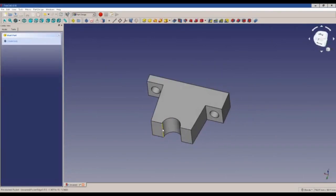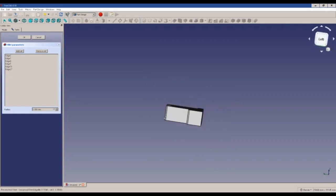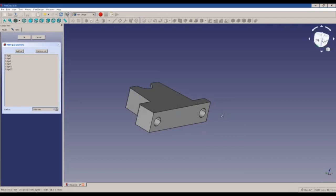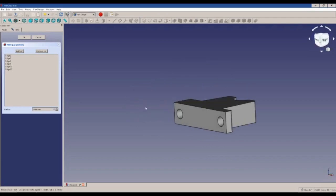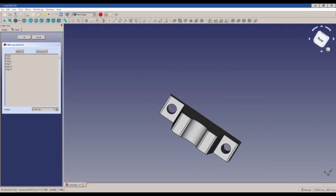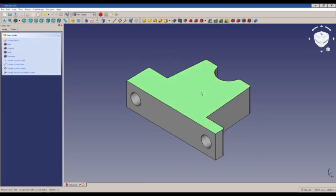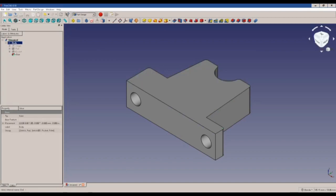I filleted it off all the top leading edges because I just didn't want any corner over-extrusion to interfere there. And that should do it. So go ahead and export this into Cura. Just going to slice it with whatever PLA settings I was using last time because it worked well, and send it to my printer through Octoprint.